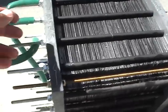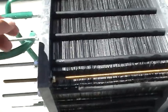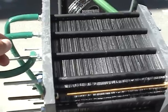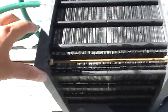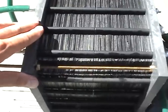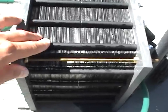On the inlet and outlet holes inside the plate, I used a three-eighths hole. If I was going to do this again, I would put a five-eighths inch hole in there — that way it would flow much better. That's where the problem was: once we hit 20 to 22 liters a minute, we had a huge flow problem, and basically it pumped all the electrolyte out of the cell.